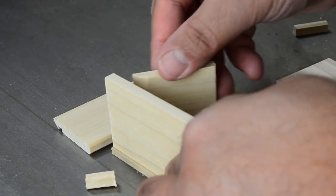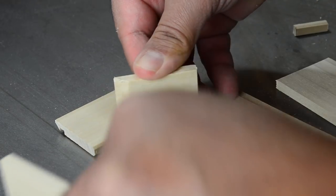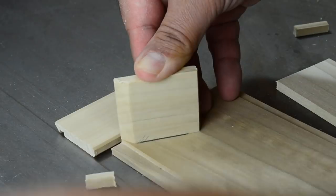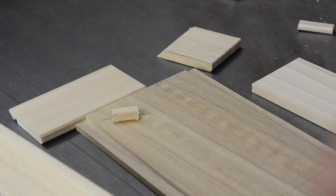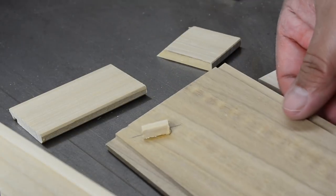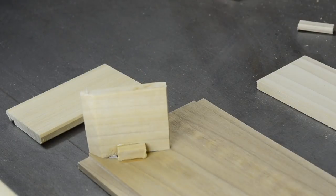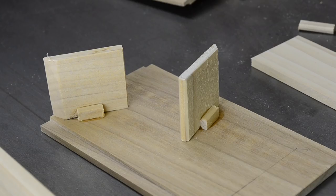When it comes to the internal ramps I don't have a specific angle I can suggest — I just simply eyeballed what looked right. To attach them I cut them to length and then chamfered a small angle on the end where it meets the side. Then I marked the location and attached a mini glue block in place with some CA glue. Once the glue set up I added more to the adjacent face and carefully attached the ramp using the side as a setup guide. Now that the first ramp is in position I just simply repeat the process for the second one.